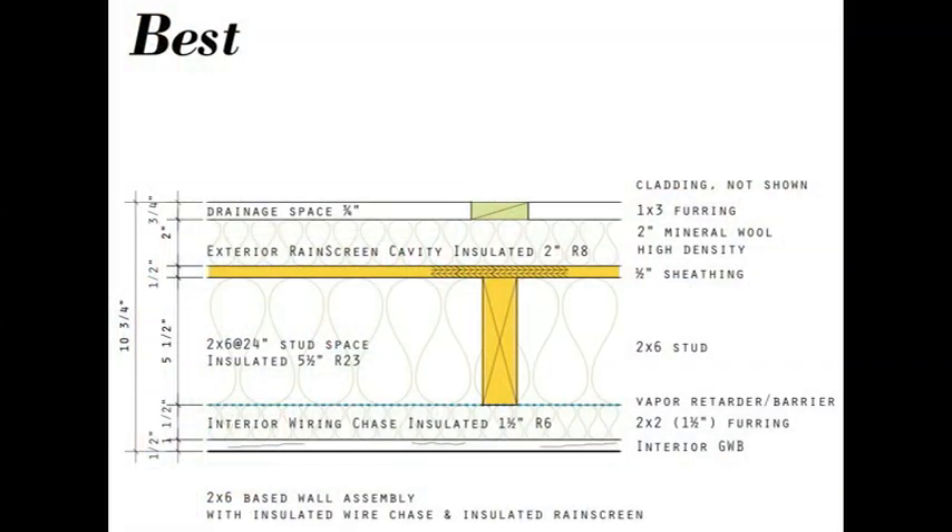The best wall completes the picture. Take the better wall and to the outside add a continuous layer of stone wool insulation — up to three inches, but let's say two inches thick. This is covered with treated furring, and rain screen wall cladding goes over that. In its densest variety, stone wool doesn't require the furring, giving you a complete thermal break from the exterior that isolates your interior studs from transferring heat outside. The total for insulation layers in the 2x6 version configured like this tops out around R38; the 2x8 version around R45. There are links in the description below which will explain the USA New Wall in more detail. Next we're going to look at advances in platform framing techniques — come back, because it's just getting good.